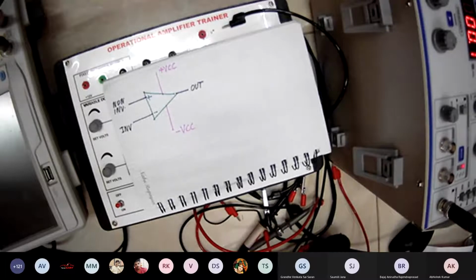Yeah, I mean a center tap transformer will not give you a plus minus power supply. We used two kinds of regulators. What are those regulators with which one can obtain a plus minus power supply? One was a positive regulator and one was a negative regulator. Do you remember the numbers? LM317 was to obtain an adjustable voltage output. We use something else. LM7812 and 7912.